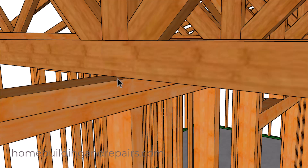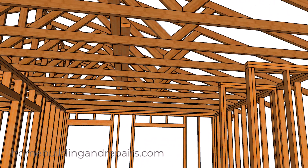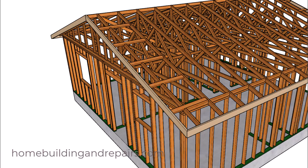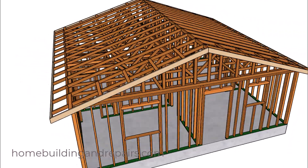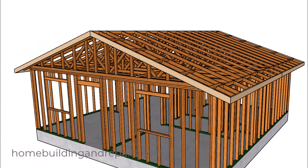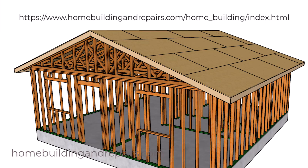Don't forget that the bottom of the roof trusses might not be perfectly flat — they might have a slight arc, which is meant to be taken out once the roof is loaded and the roofing materials have been installed. Next, let's take a look at the bottom — that would be the ceiling in the living room. Let's go ahead and put the fascia board on. Since this is a straight gable roof, installing the fascia board shouldn't be that difficult. It's a little more difficult with a more complex roof, and examples of that are available on our website in the home building project area.